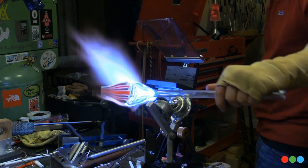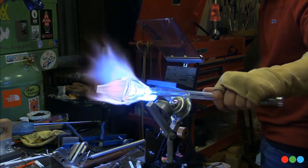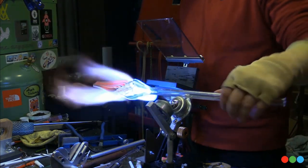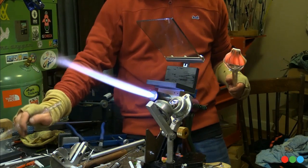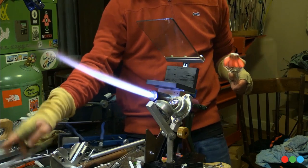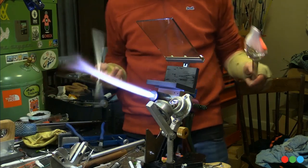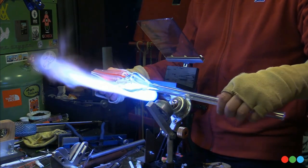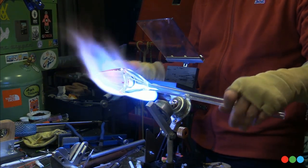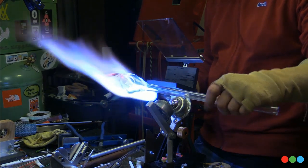On a pull like this, comb encasements, anything, even a vac stack, I really like to go right back in on the blow tube end fast, because that end just has the most sketchy glass, and bringing it back up is an opportunity to trigger that. That's what I was mentioning earlier, right? That thermal and mechanical stress thing.